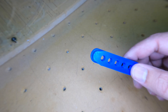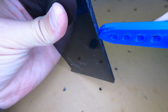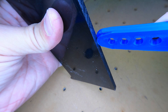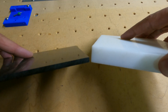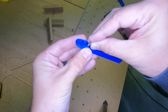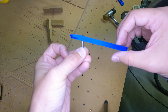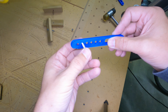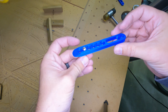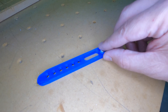The second requirement was that it had to work with the T-nuts installed on the bottom MDF. I had placed these 2 inches apart, so the arm of the clamp needs to reach at least 2 inches, and shorter if possible. Third, it needs to be able to handle different thicknesses of materials. This can be accomplished by swapping out the screws, but the screw holes in the plastic need to accommodate the different angles of the clamp.